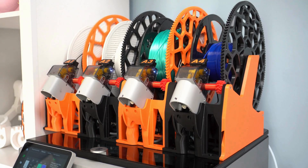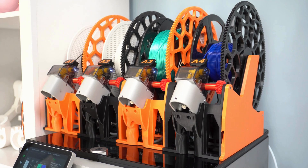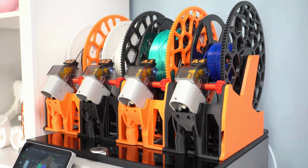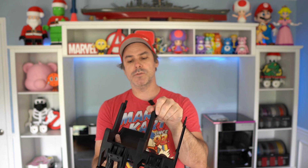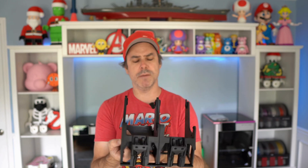This is a good design, so honestly I don't think you need all of the screws — get in the ones you can. Ideally you just don't want it to fall apart when you move it around. Once it's stationary in the enclosure or on top of your printer, make sure you've got enough screws so things aren't going to vibrate. Most importantly are probably the top screws, because that's where the actual gear drive for the spool sits and you want that to be as secure as possible. Don't skip those, but maybe skip one or two on the bottom.